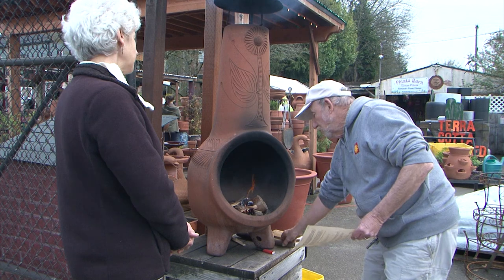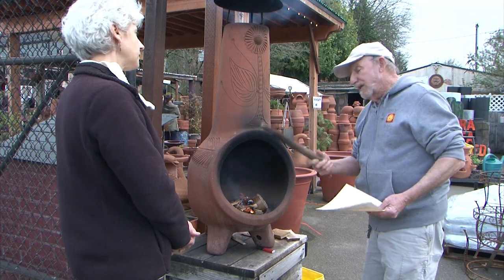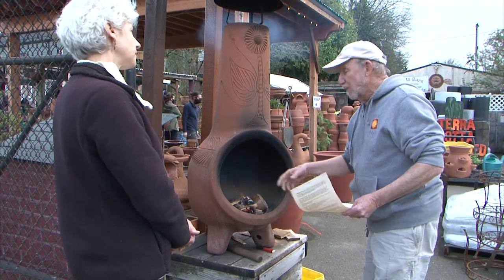Don't put anything down the stack. Don't use any metal tools. Give yourself a wood poker like this here so you don't cause a chip that might turn into a crack.